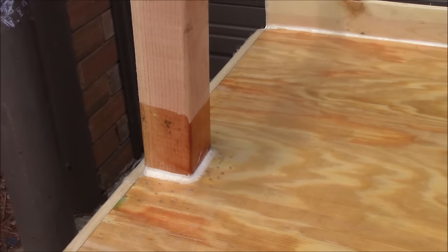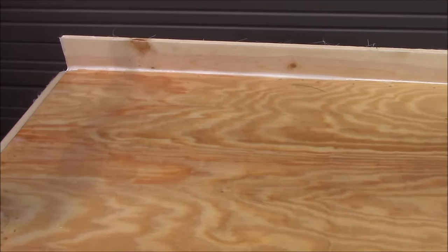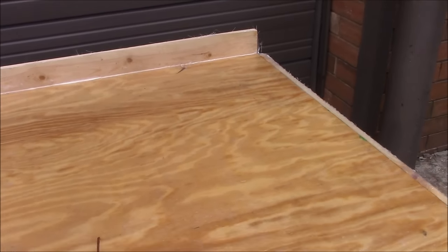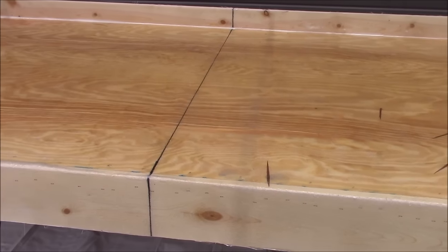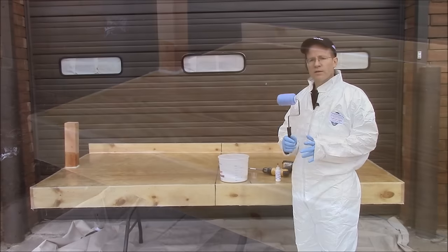Now see what the deck should look like when you're finished. If you have any white spots, that means there's a spot where the chop strand mat did not get properly saturated. All you have to do is either sand those out or cut them out with a carpet knife, take a little piece of chop strand mat, saturate it with resin, and put it on that spot. If there are any white spots, cut them out or sand them out, then put a patch of two-ounce chop strand mat and polyester resin on it and let it dry.